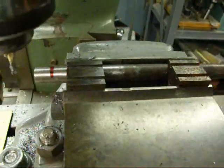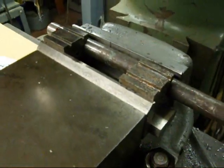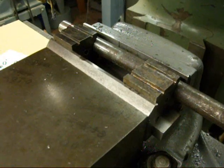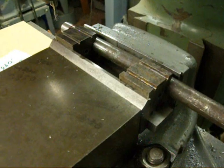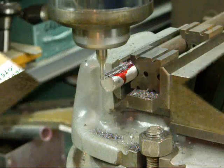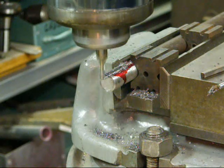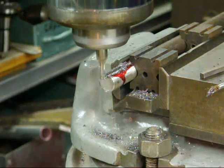One v-block is not enough — you need two. Also, this vise has been indicated in recently so I know it's on true zero. Otherwise you're going to get a keyway that is crooked, slanted, or not running down the center line of the shaft. All those little details have to be taken into consideration. I'm ready to start my fourth and final pass, which will be ten thousandths deep. We call that a clean-up pass. I've already put a little bit of oil on the cutter and I'm starting to feed it in.